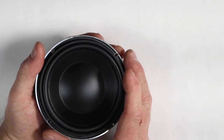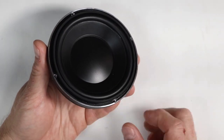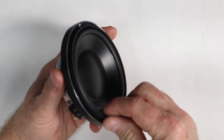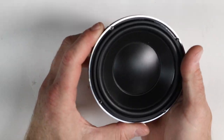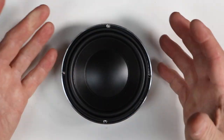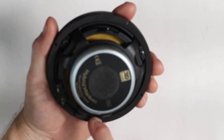It uses the same Hexatec voice coil. The cone is made out of a material they call DPC. This stands for dampened polymer cone. One other thing is the rubber surrounds. And if you're looking here, you've kind of noticed this is a little bit different shape-wise than most fours. Like, where, how, what, where's the screw downs? There are 4 little holes here. And if you flip it over onto the back, there's 3 screws.